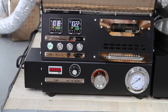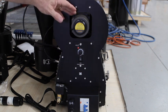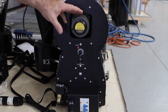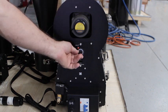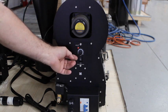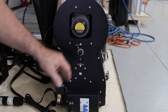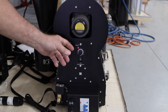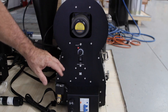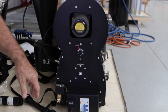I'm going to take you to the back of the unit. On the back, you've got your drum motor right here. The drum speed control is right here — it's a knob that you turn from just the on position all the way up to 10. Generally we do our roasts with this set between 7 and 8. This is not RPM; you base it on the tumbling of the drum at about 45 RPM, which is usually right around 7 or 8 for roasting coffee.